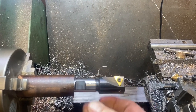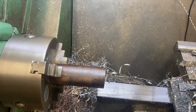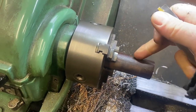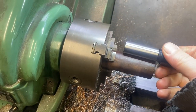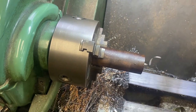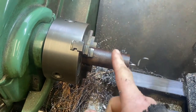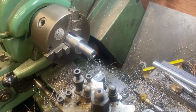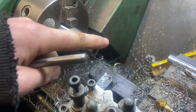That's not bad — the air isn't getting past it, causing it to hold, so that's a good fit. I just need to see how far in it goes, mark it, flatten it, and add a grub screw. Then spin it round and turn the other end down to fit in the collet. There it is, finished. I've also put a decent-sized hole up the centre and faced off the end with a slight chamfer.